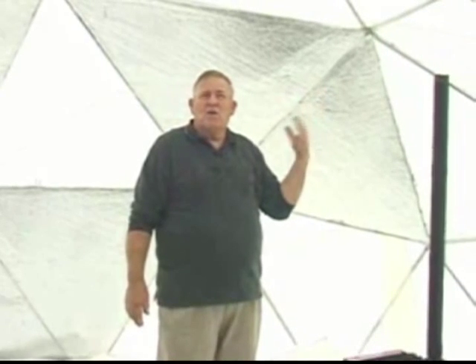In terms of how do we assemble this, let's discuss just a little bit about what it takes to assemble it. In terms of carrying it, the whole assemblage weighs 220 pounds in six packages, excluding the stove. The frame of the structure — the geodesic frame — is 120 members. They come in two 50-pound satchels, heavy canvas satchels, so that they can be lifted and put in the automobile very quickly. It comes with fasteners. The entire frame can be put up by two people without a ladder, starting at the top and just raising it as you go, in two hours or less.